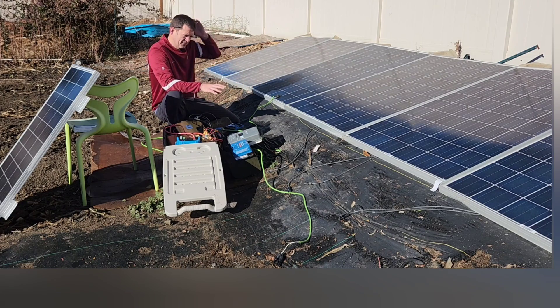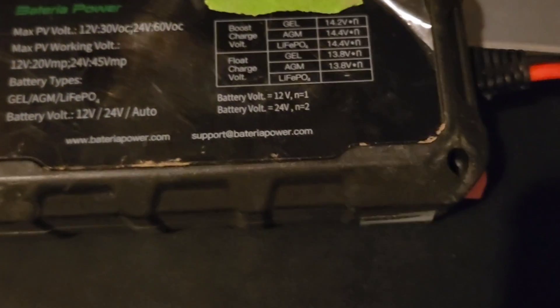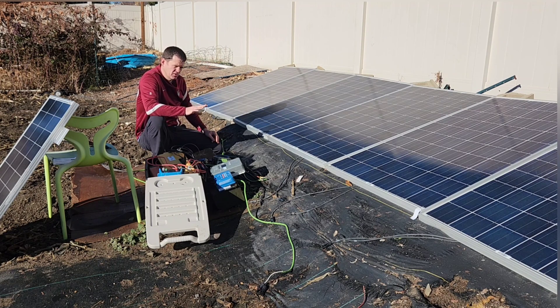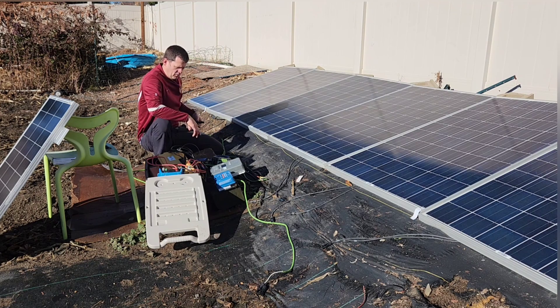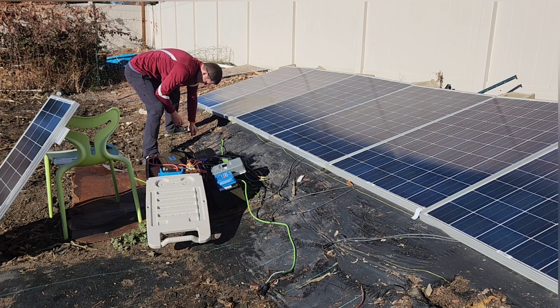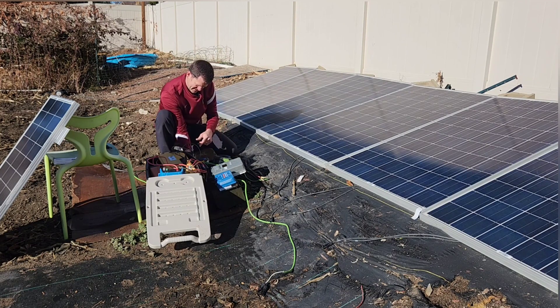Let's try the all-day test — it's sunny. These cheaper charge controllers may not work with this test in the sun, but I'm going to plug them in and see what happens. Earlier I tested the open circuit voltage and short circuit current of these, and they're all behaving very close so it should be a fair test. We'll plug the cheap one in first. It's December 4th, super sunny, and 40 degrees out here. The cheap charge controller is actually working — nice, that's good.